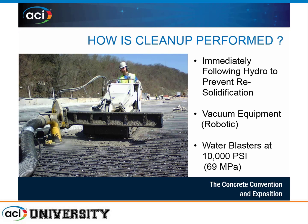When you're performing hydro demolition, you generate significant spoils — solid debris and wastewater. Cleanup must happen immediately or very close behind the hydro demolition process, as you do not want solids and spoils to re-adhere to the deck. It can be done robotically using a robotic vacuum hood that traverses back and forth, vacuuming up spoils left behind. Many of these robots have integral 10,000 PSI water jets that churn up debris and fines into the vacuum hood, which can transport material hundreds of feet to a vacuum truck.